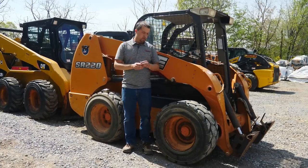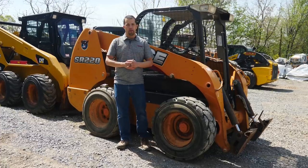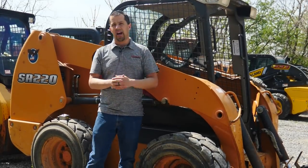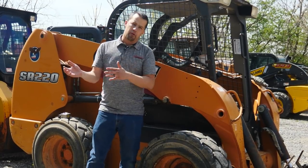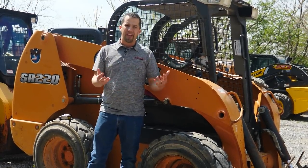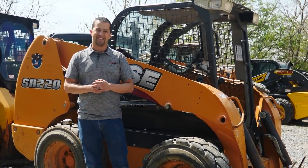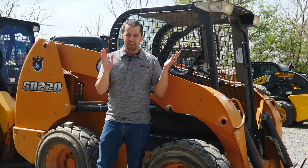Because of the nature of the work that these machines do, skid steer tires take a lot of wear and tear. If you're out working on concrete in a dairy barn, a job site, or doing scrap, a lot of times you're going to see guys have tire wear issues. If you're sitting and skidding that machine back and forth across concrete, they'll wear quickly, or if you're in a construction type environment, guys will puncture them all too easily. Sometimes when those kinds of things happen, it leads you into a place where you might need to consider replacing one tire or two tires, depending on how they wear.